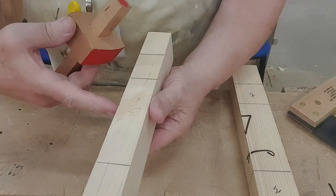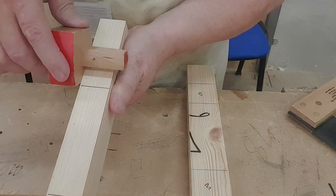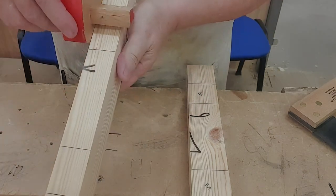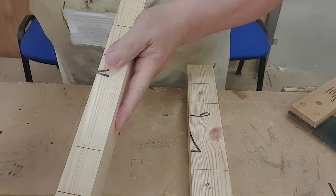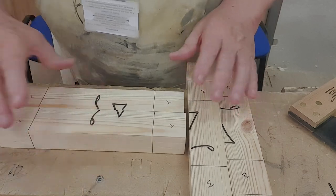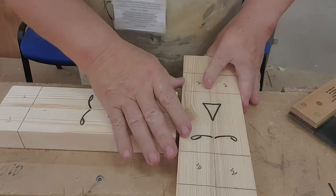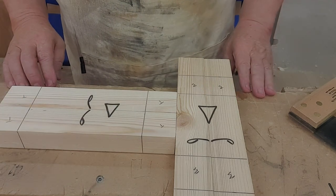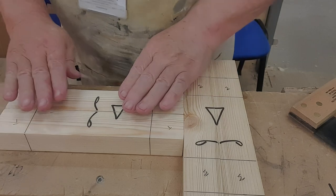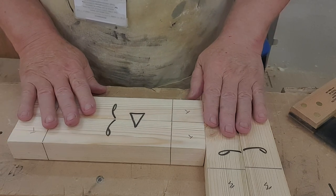This particular piece has a big knot, but the knot is not in the way of the mortise. I mark the same on all remaining pieces, always with the stock on the face side. Now we've got all the wood sorted out, so I put them all back to where they were using the triangle to guide reassembly. The first thing we'll cut is the mortises — there's another video explaining how to cut mortises, and another for the tenons. But that's how we mark out wood, and in this particular case, how we mark out a frame.